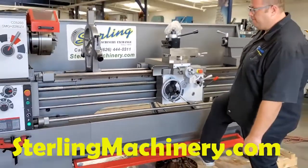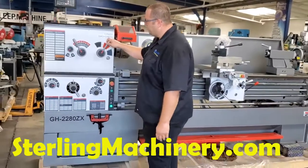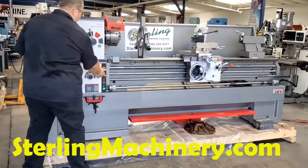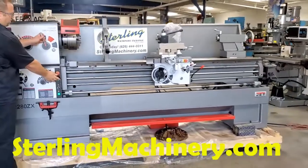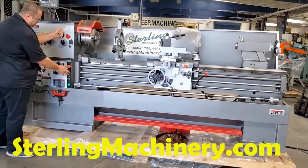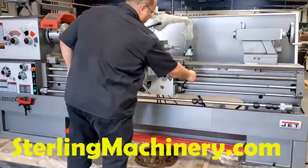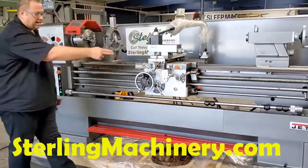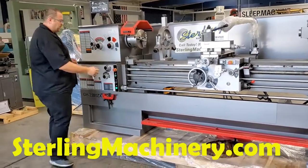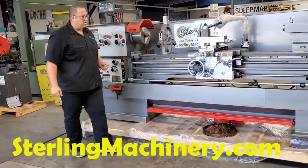You can see our foot brake stops the machine instantly. We'll go ahead and change this to a different speed range — we're going to put it into the black range. When we do that, we can go ahead and jog it to make sure we're in the right feed. Make sure that's in. It has a key right there. Once it falls into that key, it lets the limit switch know. You can see we jogged it and we're in the correct speed.